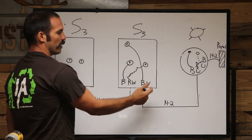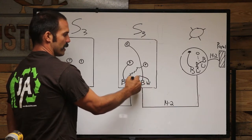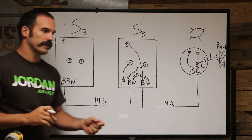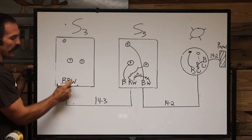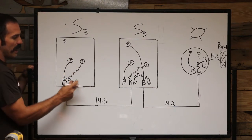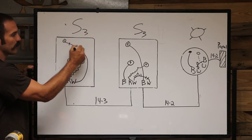The white wire, which is a re-identified hot, will tap with the other white wire — I've put little marks on there to indicate electrical tape. In your last box, the black and red from your 14-3 are travelers and go to the traveler screws, and the white wire, which is a re-identified hot, goes to your common screw.